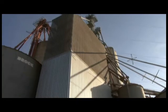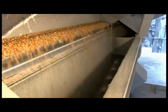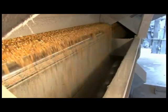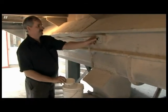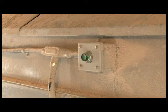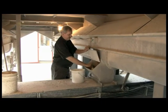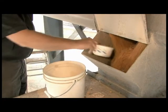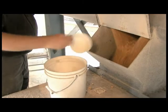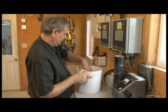We recommend the following procedure for calibrating the outlet sensor. A: Go to the dryer and make sure grain is flowing past the sensor. B: Press the sample button next to the outlet sensor — the light will flash. C: While the light is flashing, approximately 30 seconds, take several small samples and put them into a container. Do not take just one sample. D: Mix up the sample.